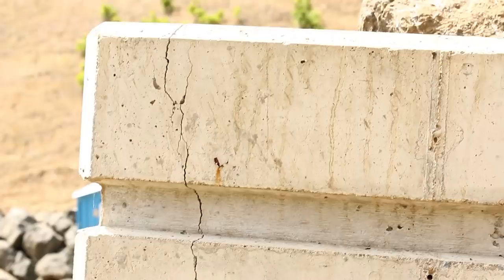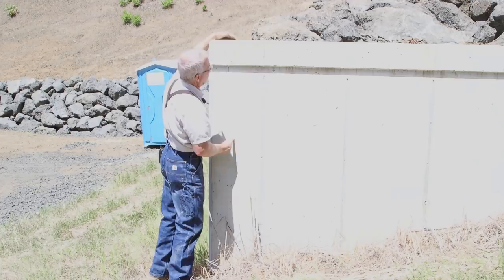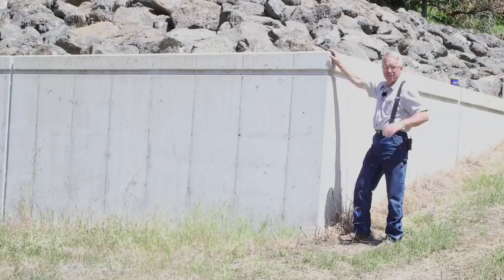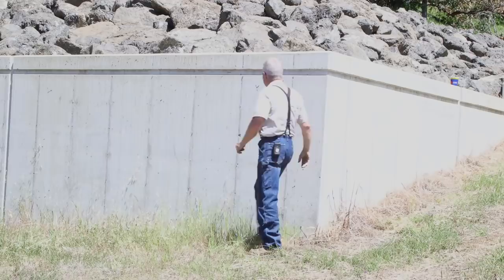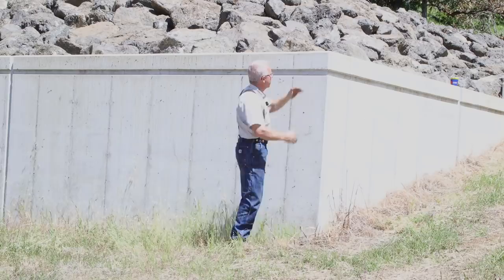A pretty good crack — it runs back into the corner and right down here. It did a very similar thing on the other side. We've got a crack over more in the middle of this panel that runs back, sort of accommodating the settlement, with the rigid corner here. I wish I would have run a construction control joint down each one of these corners. If it wouldn't have solved it, it sure would have minimized it.